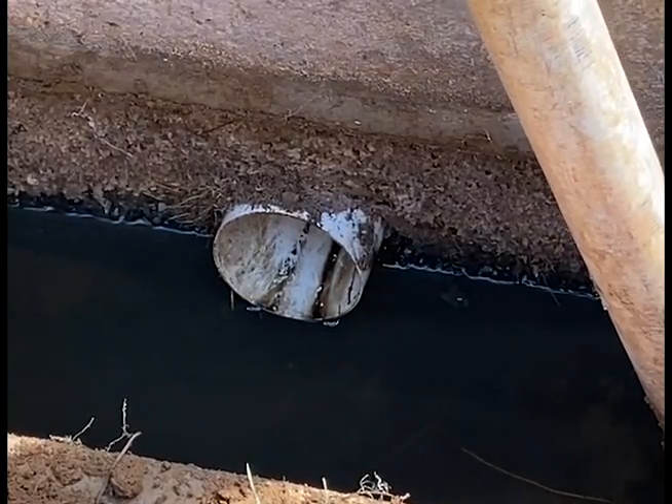We're going to watch the bottom left counter as we go in. We're about 35 feet into this trench, going all the way to the end to make sure we don't see any breaks, roots, or any weird shenanigans in the pipe. We're now getting close to the end of the trench — we can see the rocks, that's the end of our line. We made it about 70 feet and 8 inches, which lines up with what we see on the records. The permit said it was a 70-foot trench. We'll pull that out and go take a look at the next trench line.